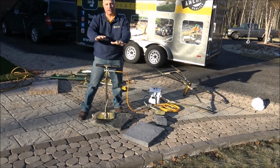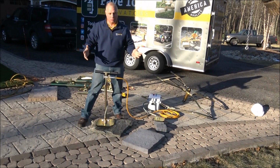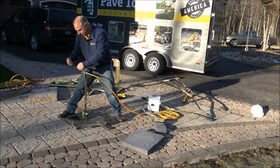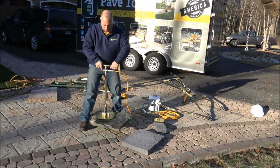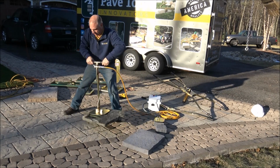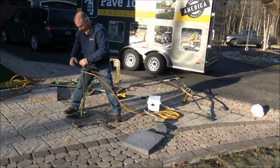And you take setting an irregular flag patio or walkway, you're constantly moving products in. You're shaping them, maybe chipping them. You're going to pull them out, right? You're maybe going to take your trowel and regrade it to get the height right. Set it back in. Okay, great.